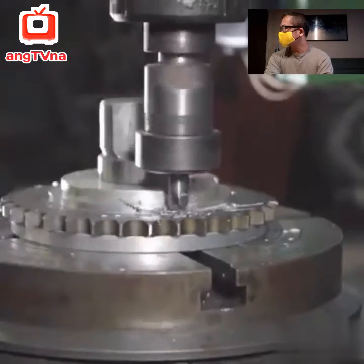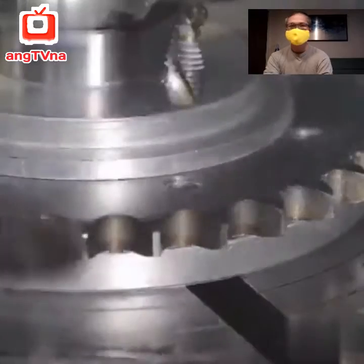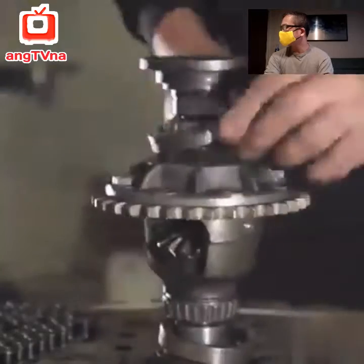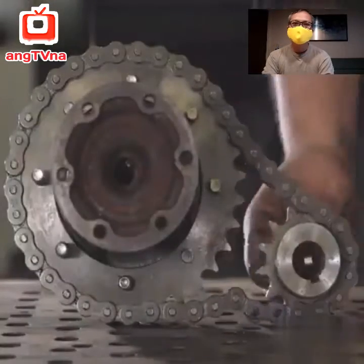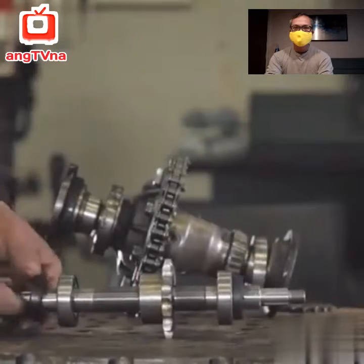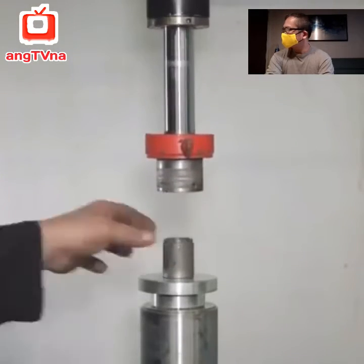The control differential adds an extension to the rack holding the idlers and puts a conventional brake on that extension. With the brake applied, the idlers are locked and the system works like a conventional epicyclic. When the brake is released, the idlers spin, reducing the speed of rotation on that side. This causes the output of that side to slow down by a fixed amount.